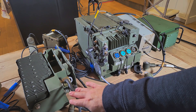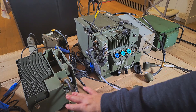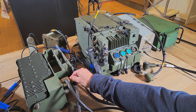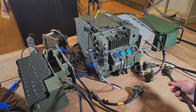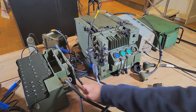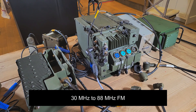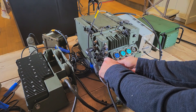Here is the external power amplifier for the top radio, shown on its side so you can see how this works. This takes two cables: one is the power cable because it needs to generate RF at 50 watts, so it needs power. The thinner one is a control cable which tells the radio what band — I think these amplifiers cover three bands, 30 to 89 MHz in three bands. This cable tells it which band it's on and any other information.